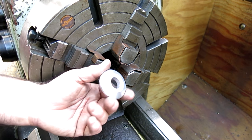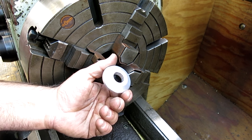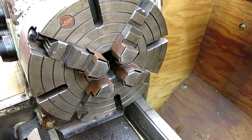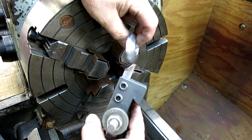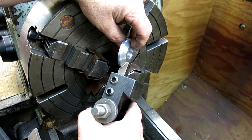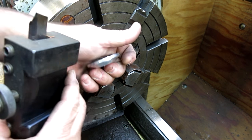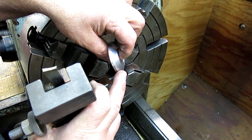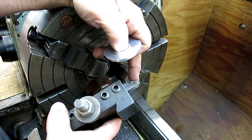Okay, so here's what we're making. It's a kind of a decorative washer for the top of the etching press. And this is a sample part. The reason I did a little sample part was because I ground a special tool bit that has the angle and this little corner radius in it in one shot there. Now, there's nothing particularly special about this tool bit. It's just high speed and ground at the correct angle, this slope here, and then with just kind of an eyeball radius at the end there. This radius isn't important to me other than it's just broken, okay? The angle was the important part, and that was easy to get